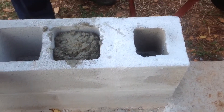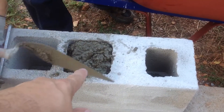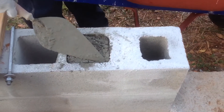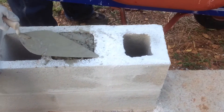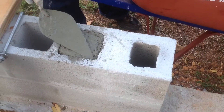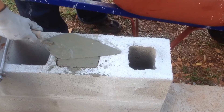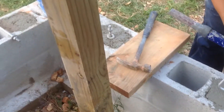On this end for stability, we're putting the anchor bolt in but also filling the block with concrete all the way through for more strength in the wall, since the house sits on top of that crawl space opening. A lot of people fill every hole when building concrete block walls — there's nothing wrong with that, and it would be necessary for a bigger house. This is a 16x16 cabin with a 16x8 extension, so we're comfortable just filling where anchor bolts go and on the corners, which we've also filled.